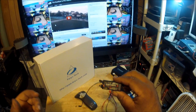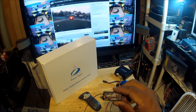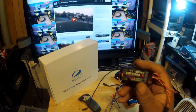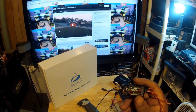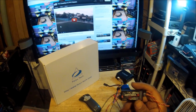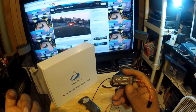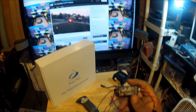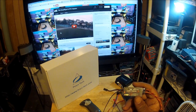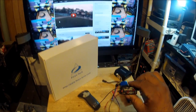But if I remove the jumper, I can connect a wire directly to the battery through the wiring harness, powering the receiver straight from the main flight battery. The great thing about that is my radio will get the real battery voltage. I can also set up a LiPo alarm on my radio so when the battery drops to a certain point, the receiver sends that information to the radio and the radio starts beeping - which is a big advantage for monitoring battery state in flight.